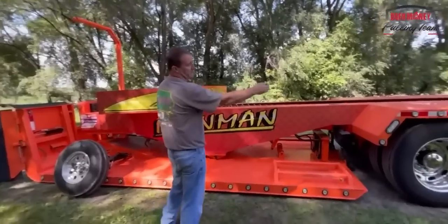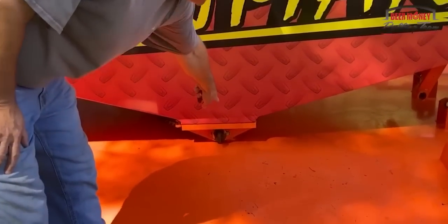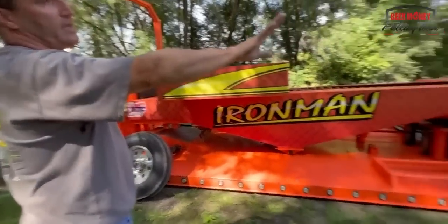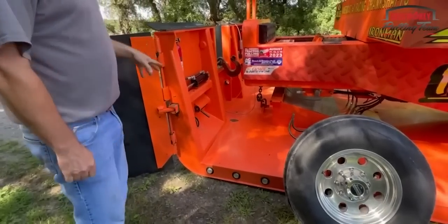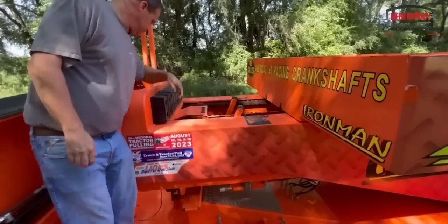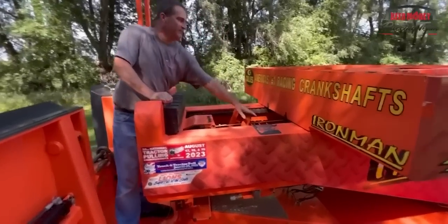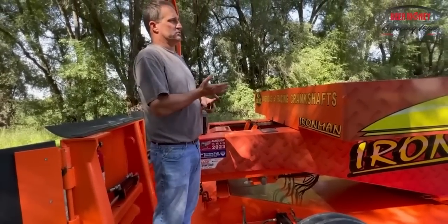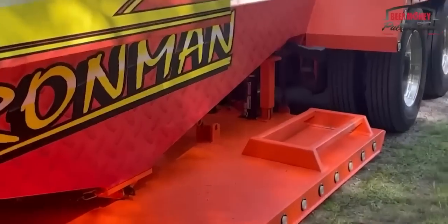And now we have transitioned from the front axle being our pivot point to this pin now becoming the pivot point right there. So once the weight box goes past that pivot point, it's actually taking weight off the back end, putting it on the front end, and trying to drive the nose of the pan into the dirt. So until the box gets up to this point right here, this bar moves, the box hits this bar, and it does a few different things. It takes the air clutch out of gear, which releases the drive line so we don't break our box chains, and it also operates our push down. So now the push down is back here.